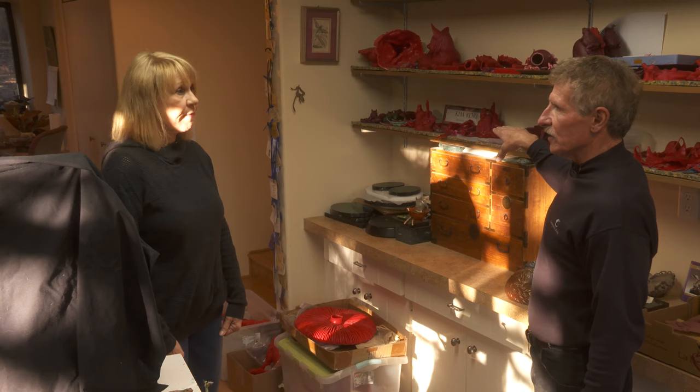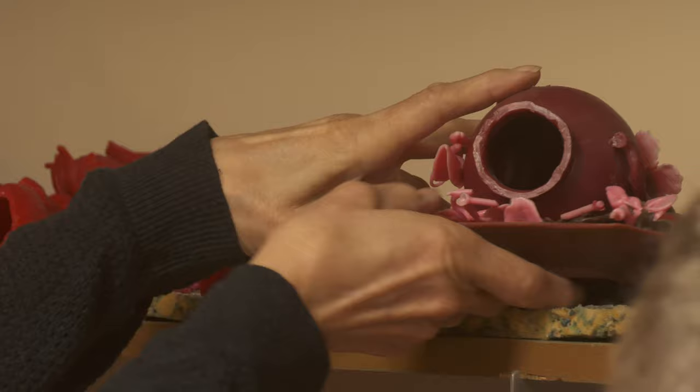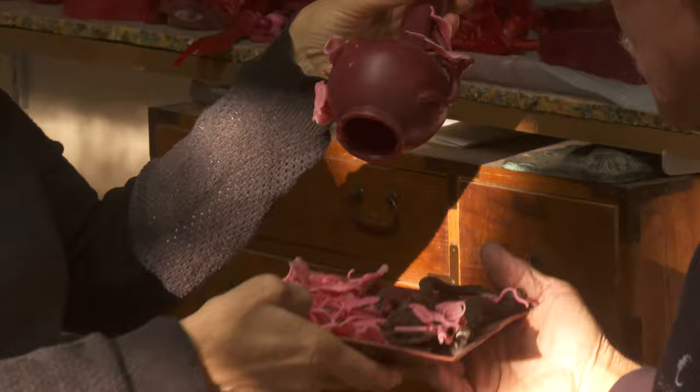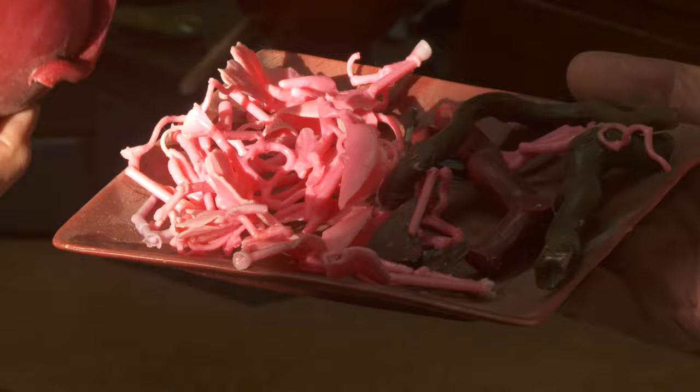Look at these parts — they're always in pieces. Jeff Christensen makes the waxes, and you get the waxes back from him. Then you do what we call chasing and hiding imperfections — there may be seam lines or anything else. Look at all the parts you have to put together on that one. That looks like days worth of work just to fix and get it to where you see right here. That's why I don't do it anymore — it's a really hard one.